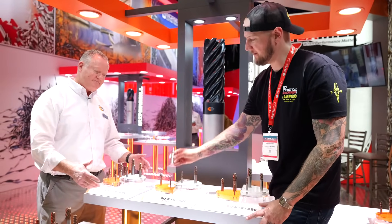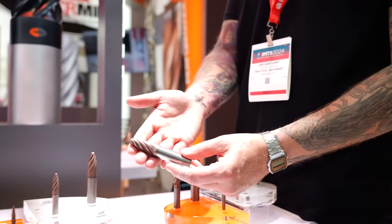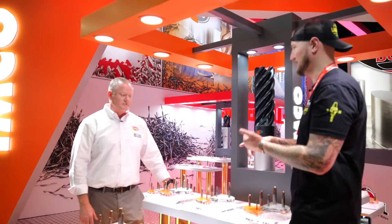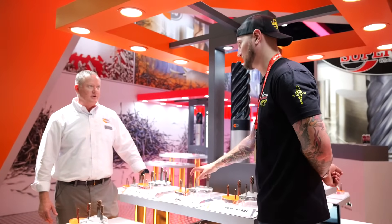And this is something I've seen around but don't know a whole lot about — the circle segment cutters that are coming out. We're going to bring those out in 2025. We're at the big tool show, so we decided to get a jump on them early and show those. We really believe in the utilization of circle segment cutters. However, we know that's a big software change and a big change for a lot of shops. That's why we like these ball nose end mills — everybody knows how to use a ball nose end mill, so if you can improve upon that design, it's a nice bridge from where they're at today to maybe the day they invest in the software and equipment where circle segment cutters make a lot of sense, because they do have higher requirements — you need five-axis, you need the right CAM software.